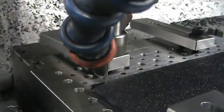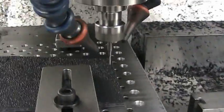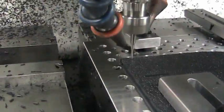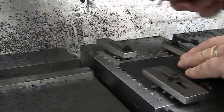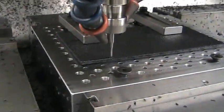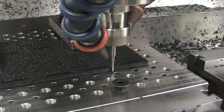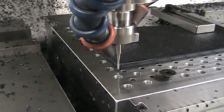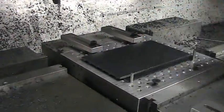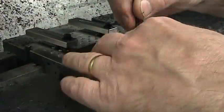Here I'm doing the base plate — milling the periphery. We have two sets of clamps on. We grip from one side and do what we can from that side. These are the alignment slots for the pieces to go in. We'll slide the other clamps in before loosening the others so that we maintain position, then come down and put the slots in on the edge we were holding. We come around and mill the periphery, then release, put a new piece in, and use dowels to locate again. Ready to go.